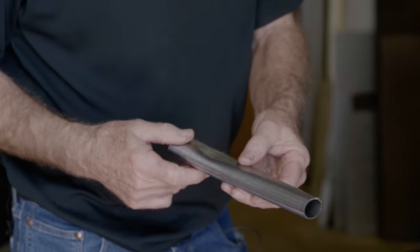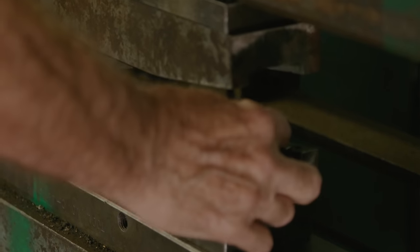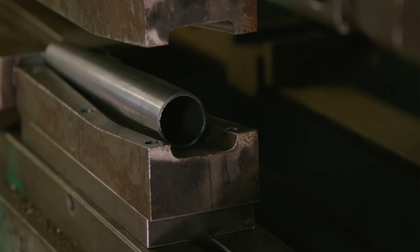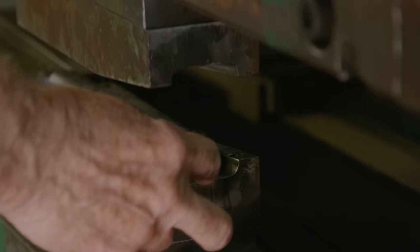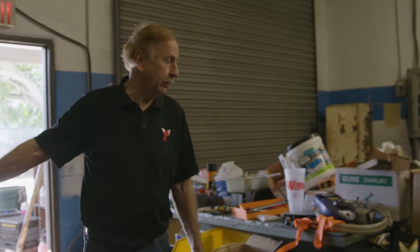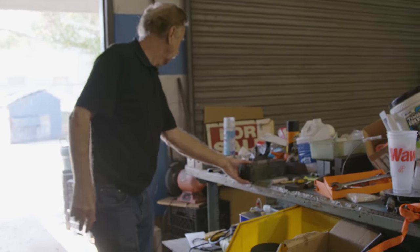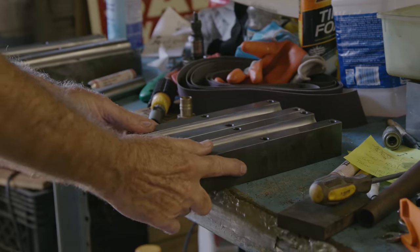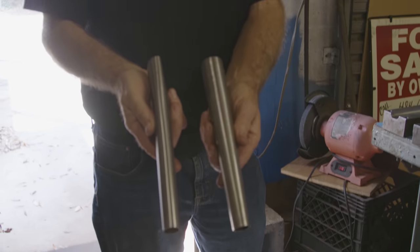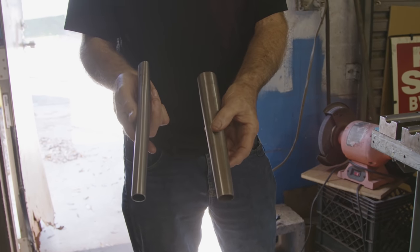On this, you're doing half of the crank. You've got to make the whole die — it's going to encapsulate the whole crank when it comes down and comes together. We know how much we want to smash it on either end to make it work in all our welding fixtures. That's the elite die. This set of dies here is for our regular cranks — the die for doing our column cranks. If you look at it, there's a little different section between the elite versus the column.